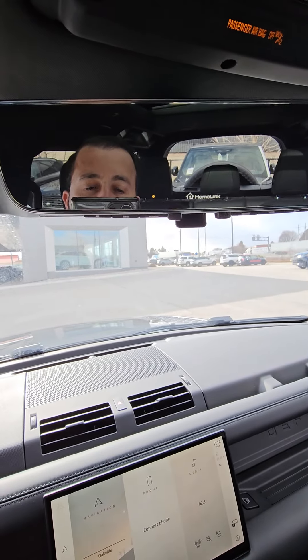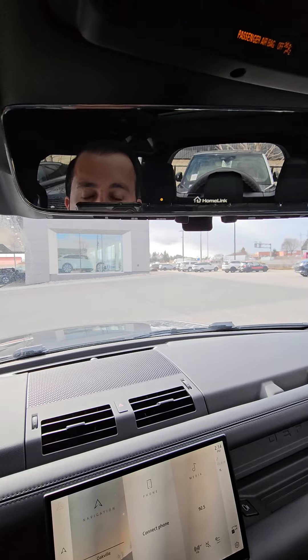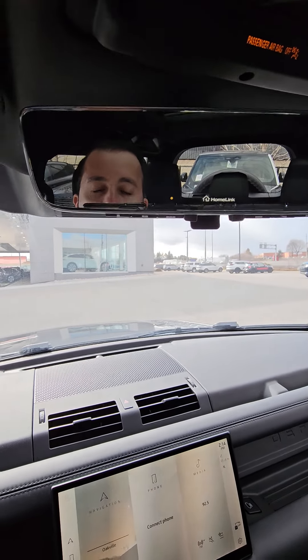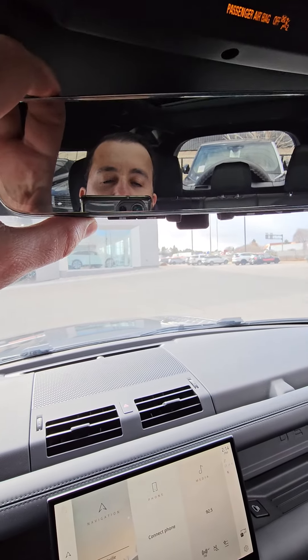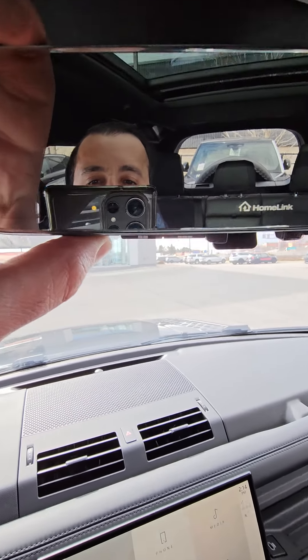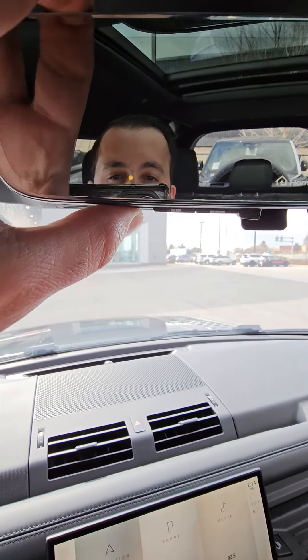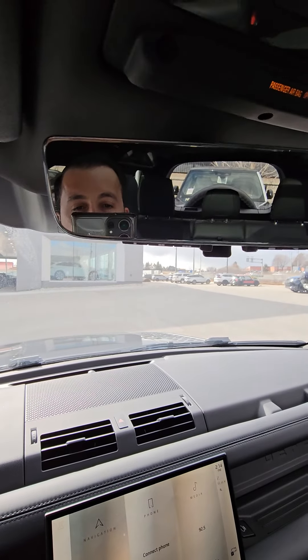The best way to do this is you have a learn button on your physical garage door motor in your garage. Press the learn button. Have a second person in the vehicle, give a thumbs up to them. Hold this button for approximately 30 seconds or a little bit longer. When you do that, the light will start to flash rapidly like that. Once the light slows down, let go, and essentially your garage door opener is now hooked up.